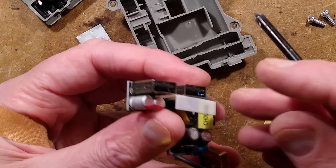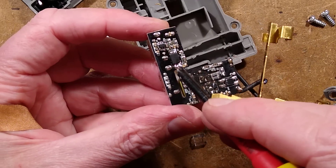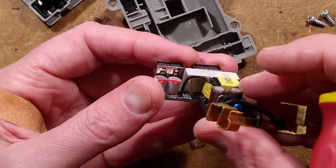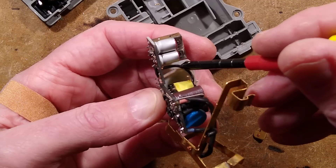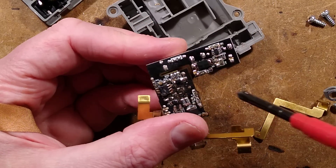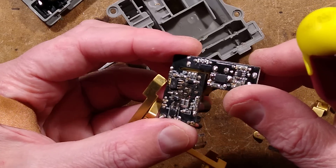In this case it may have come out there — I don't see an awful lot of scorch marks around here, so it doesn't look too bad. And with the British General stuff, I mean there's good separation there as I'd expect from them. It's got double-insulated windings on the transformers, potentially even triple-insulated. There's the diode. So it looks as though it's just been a random failure — it's just decided to pop.